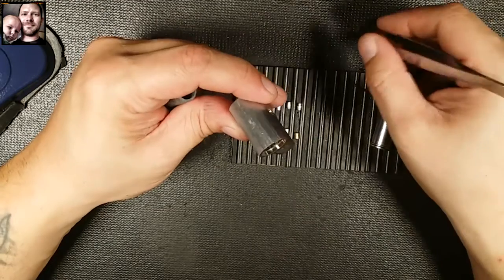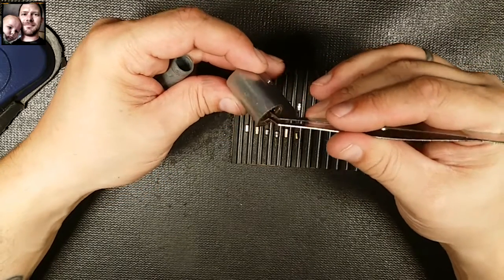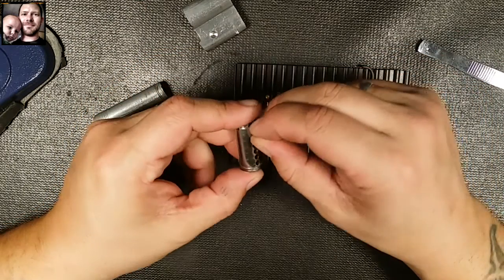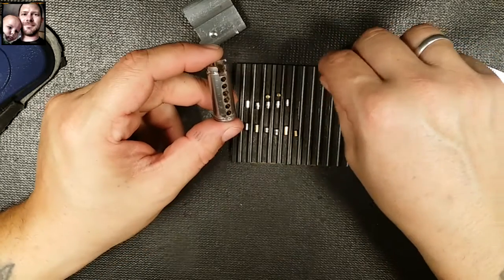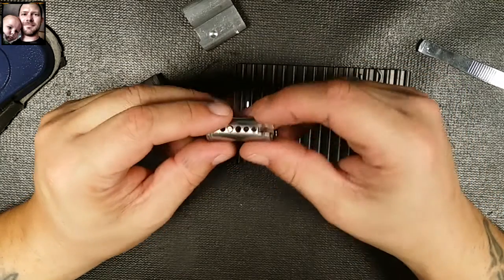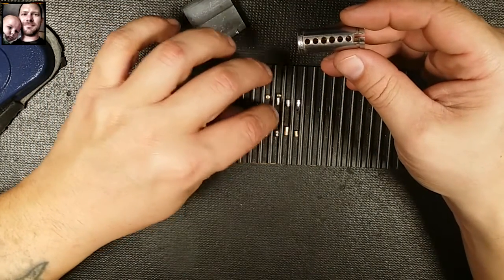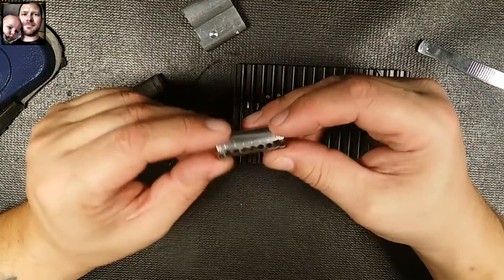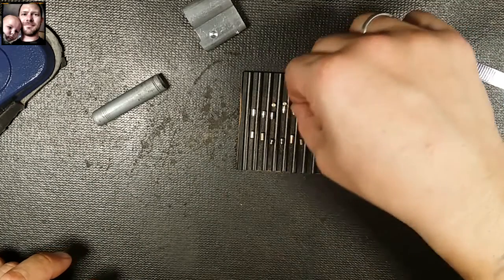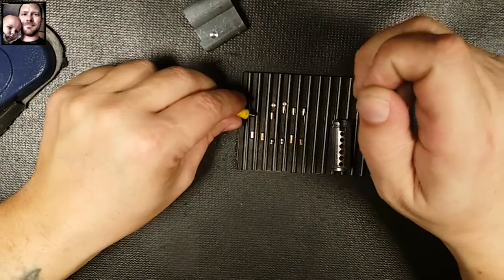Let's check a random chamber here to see if there's any counter milling or anything. No, it seems normal. I just want to see if these are actually bump stop or what's going on here — that one drops right in. Let's try one of the enlarged chambers like on three. No, it does not drop right in. So these two enlarged chambers on three and four are for bump stopping. I'm not sure why they'd have wafers on top of them, but they do. And these other two are bump stop type pins but do not work as a bump stop. So we have steel pins — looks like they're all steel pins up top.